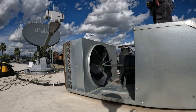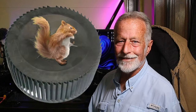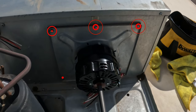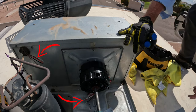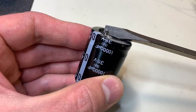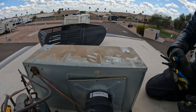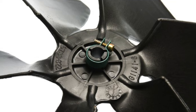There are a few tricks and tips. The new motor should match the specs on the sticker as the old one. It should be a through shaft — the shaft should stick out on both ends. The fan will be on the longer part and the short holds the squirrel cage. It's mounted to a plate that has five screws that hold it to the forward evaporator box, as well as color-coded wires the same as the old. Then open the electrical panel and use an insulated screwdriver to short between the terminals of each of the capacitors.